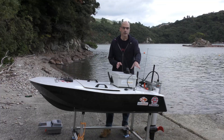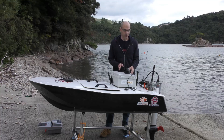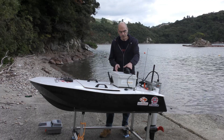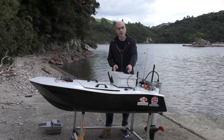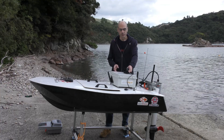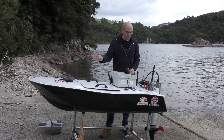That sonar data along with some extra GPS data goes off into the cloud, which allows real-time monitoring of where the boat is from basically anywhere. It's also got this little camera on the top so it sends pictures at about 0.3 hertz — once every three seconds it sends a live picture facing forward.